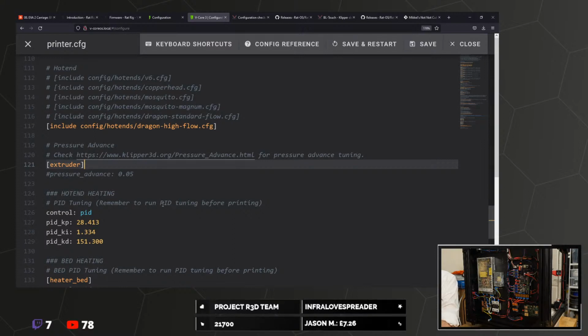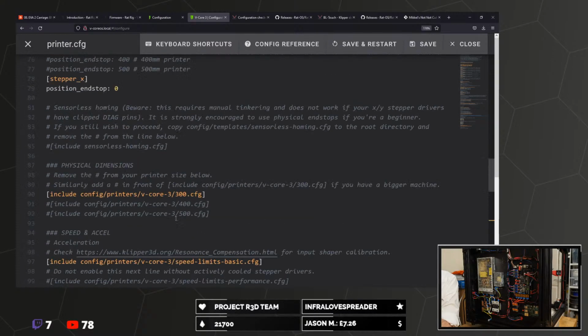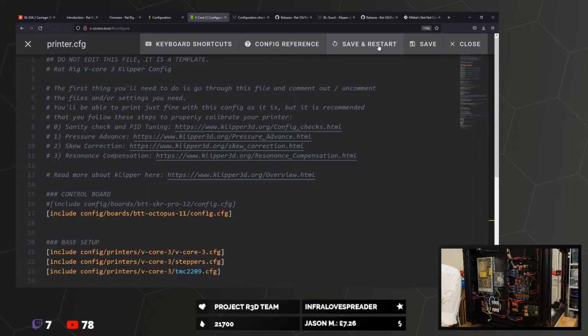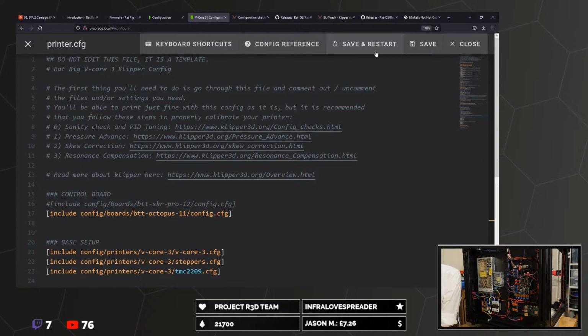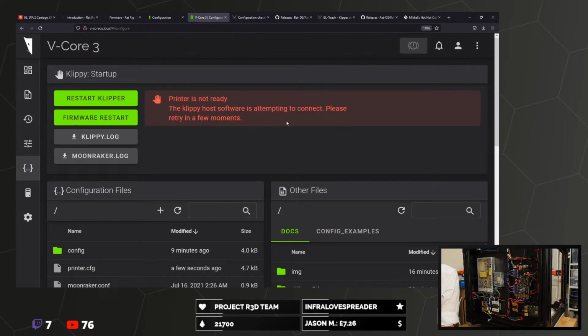Why not a fan of sensorless? Just because it's less accurate and because you have to actually put effort in to tune it to get it to work properly. And with CoreXY, because it's not independent motors, it's more complex than it needs to be. There's nothing wrong with it really. It's not as accurate, but it doesn't really matter. And given the amount of effort it is on this printer to add endstops, which is almost zero, I'm happy just going with it as it is.